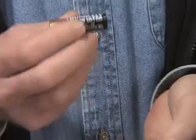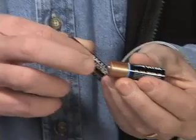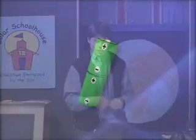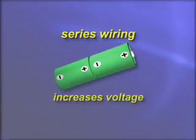Through the magic of electrical engineering, we've learned that if you stick two one-and-a-half-volt batteries together in series — which means the positive end of one touches the flat end, or the negative end, of the other — you've created a three-volt power source. If you connect two power sources together in series, the voltages are additive. And that's what you do when you stick these into the flashlight.